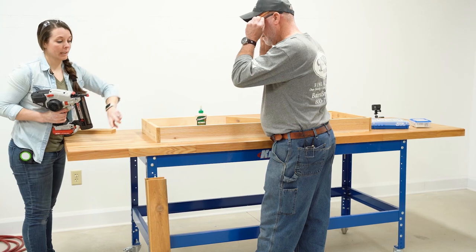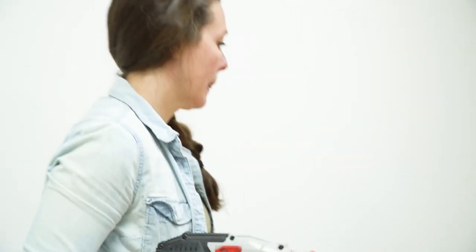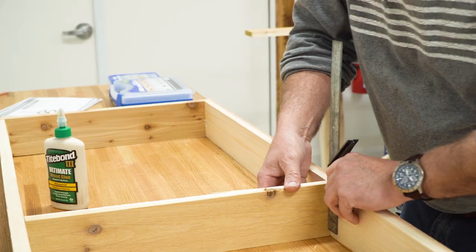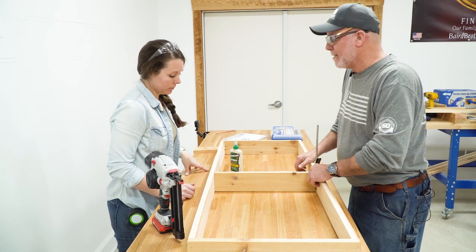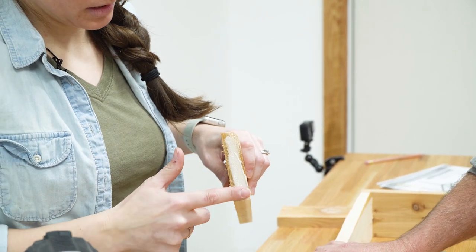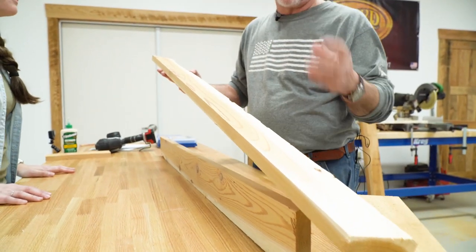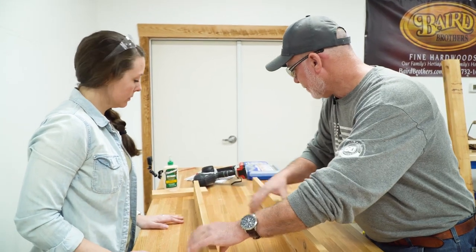If this were me working by myself at home, I'd try to clamp this whole thing because that's like my second pair of hands. One of the most valuable tools in the shop is the combination square — we can work that piece nice and plumb and square for just that real nice appearance. We want it to turn out nice and look like we cared. Sometimes cedar boards will have this runoff or wane — in this case, we're going to turn that down.